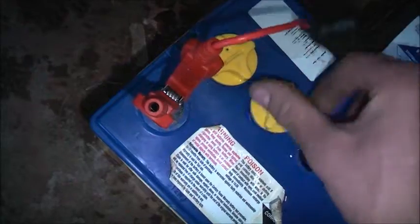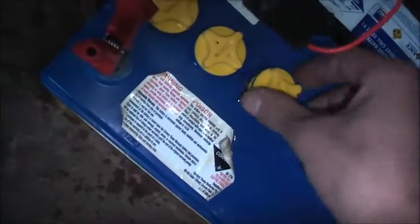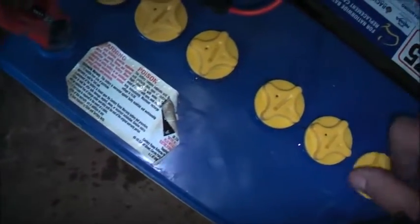Let's get that first battery, put a load in it and let it get right flat. I'll cycle it a couple of times to form the plates - then it's truly ready. The characteristics though - these charge up quite quick too. Charge that one overnight, then drain it to form the other plates. I think charging forms the positive plates and draining it down forms the negative plates.